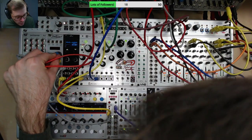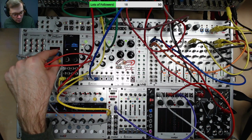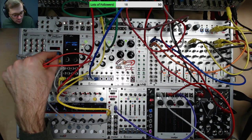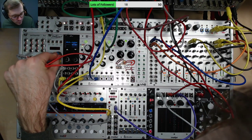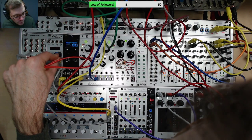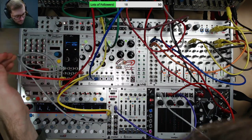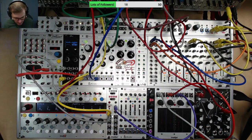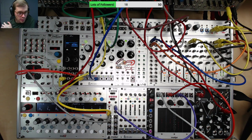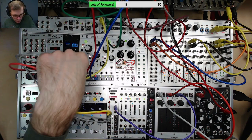See what I'm doing? I'm just gonna set up a really simple clock. We're already on gates. Oh, and I gotta turn off the random skip because that won't be helpful. 0%. We don't need any steps or E-trigs or rotations. Man, I should have just reset this. Oh well. Okay, so we're gonna have a clock. Might be a very fast clock, but we'll see in a sec. A little too fast. It's a bit better. Okay, so now we're at least clocked from something. Now we can, oh my goodness, where was I going from here? We were clocked. I wanted to clock Rainmaker, right. Let's just mult this out.